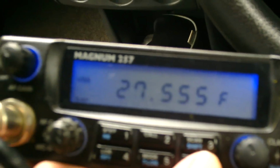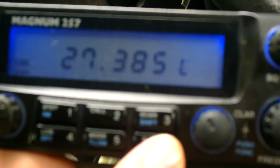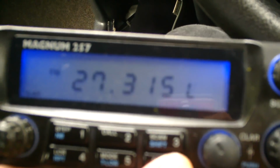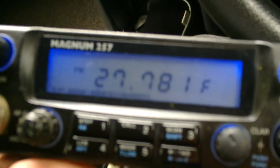So let's say I go to 385 LSB, the calling channel for international QSOs. We're going to go there. 1, 2, straight to it. 27385. Now let's say I want to go to the German calling channel on mid-band 315 FM for chasing the skip or whatever. Straight to it. Straight to it. And then back to 19. It is as simple as that.